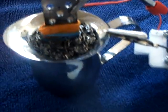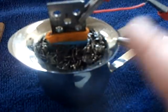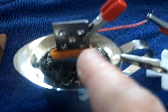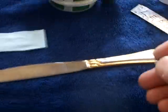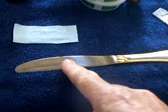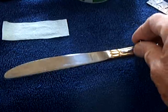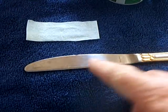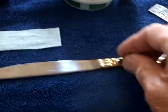I went one step further and thought, let me try something else. Because when I took one of these apart and looked at it, there wasn't anything going on with the negative plate — the positive plate perhaps, but the negative plate was just acting kind of benign. So I tried this: a table knife, flatware, made out of stainless steel that's very magnetic. It probably has 13% or 17% chrome with the steel and probably very little nickel because it's so magnetic.